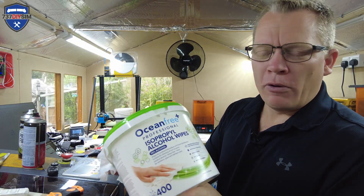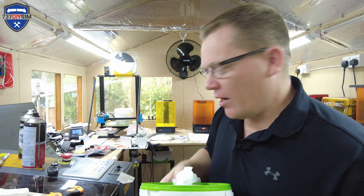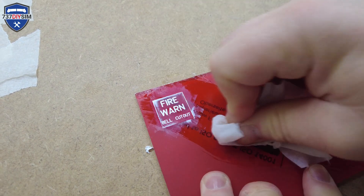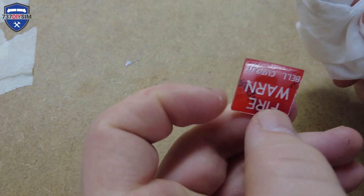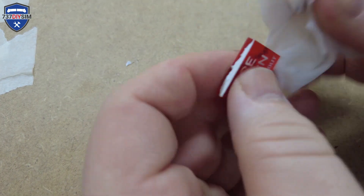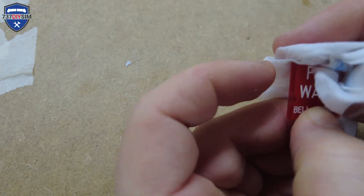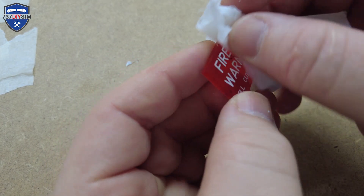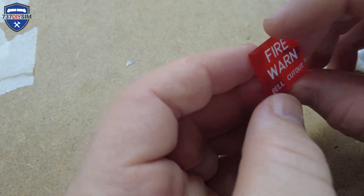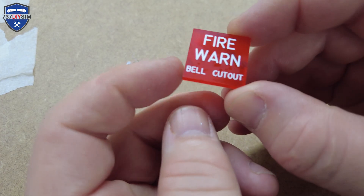I use isopropyl alcohol wipes because they're absolutely fantastic at getting the wax off the parts. With the wipe, just go over the top. You can pop it out and then take the wax off the sides where it's accumulated. Get rid of all the bits of wax because we don't want any excess wax on the part when we spray it with lacquer. Just checking all the sides — and that has come out really well.